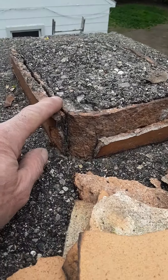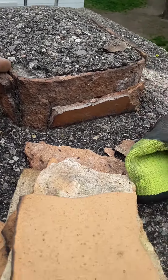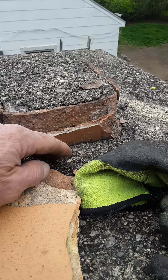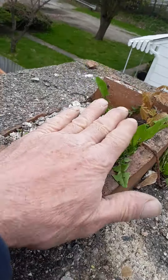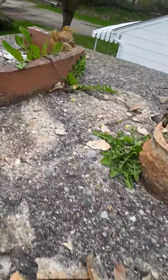These are dummy flues, known as decorative flues, and they're breaking and letting water get into the chimney. There's a good concrete cap here — no need to replace that. But these decorative flues should be removed and patched over with concrete.